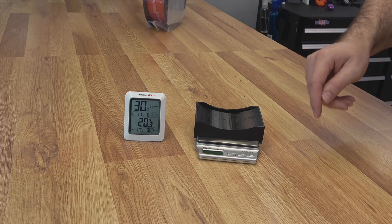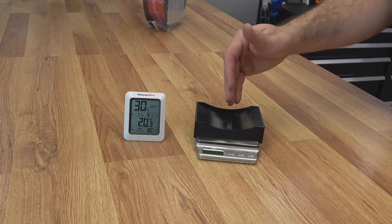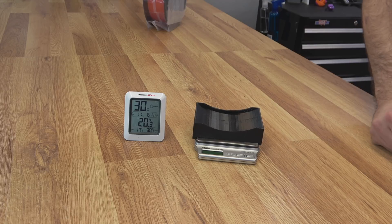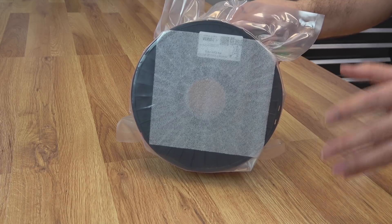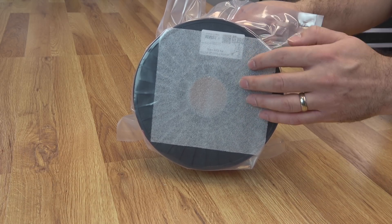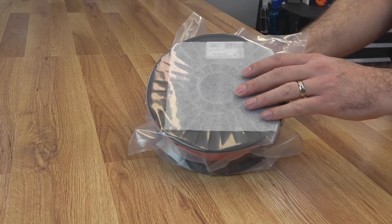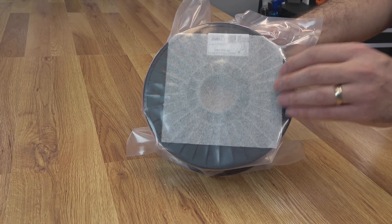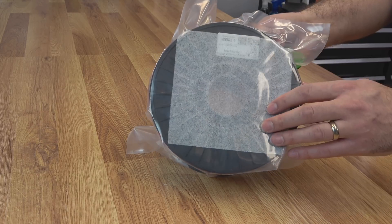Even at 30%, I'm expecting it to pick up some moisture. After all our tests, we're going to gauge the whole thing by weighing it using this little cradle I made. Most filament manufacturers are going to pull the air out of the packing before they send it to you — Printed Solid included — and they also include desiccant to help keep it dry. The manufacturing process goes to great lengths to dry this stuff, just so they can extrude it into filament. So let's see what the baseline is for a fresh spool of Printed Solid Jesse PETG.